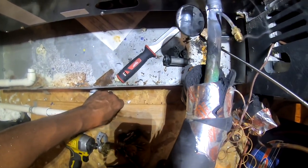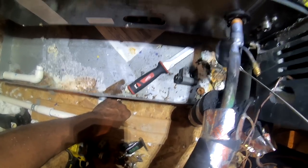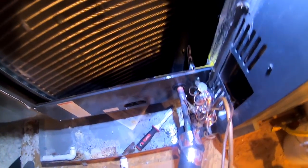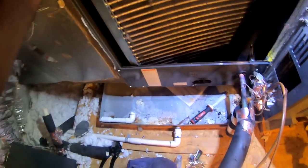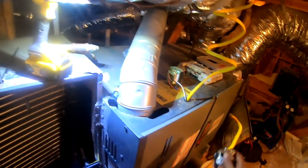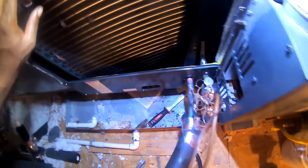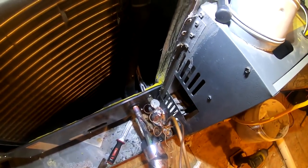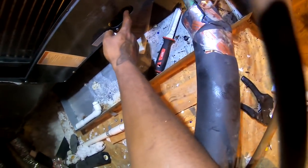At the bottom. All right, let that cool down, put the TXV on there. Real leak search. All right, so I just did a nitrogen test on it at 300 PSI, and it held for about 10 minutes, so we should be good. Now I'm pulling the vacuum on it. I think all I got left is the drain line up here. This is secondary on this side.